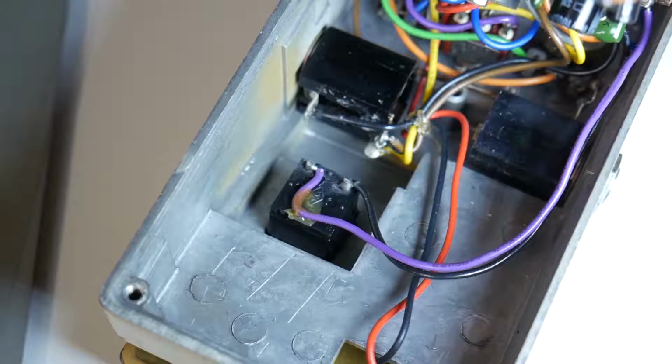The first thing is there is a note on the back that says, for longer battery life, always keep the cord disconnected from instrument jack when not in use. So that would be the input here on the side. And I thought that was a little bit interesting that that would affect drainage of battery. But then when I was looking at the circuit inside, I noticed that the leads from the battery pack seem to kind of intersect with the input jack's wire leads as well.